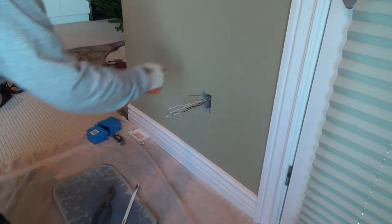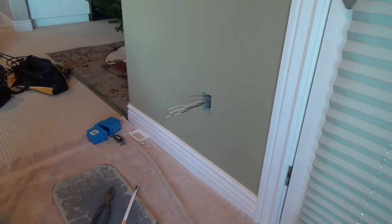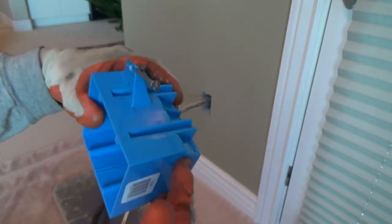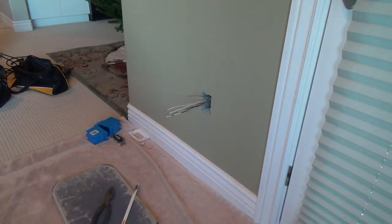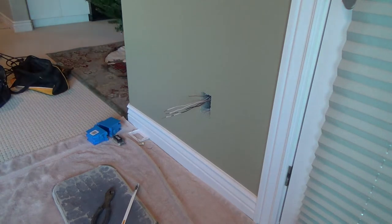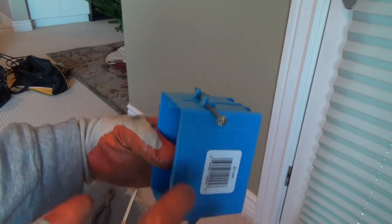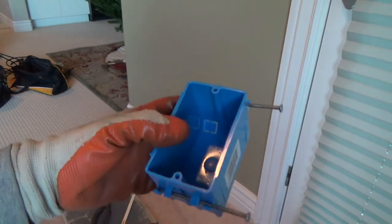To get this box out, there are two nails on the side. This is a two-gang box, but that one is just a single-gang box. The nails come through the backside and then through the edge. Here's a single box with the nails on it — that box looks just like this one. It's nailed right to the side, one up here and one down there.